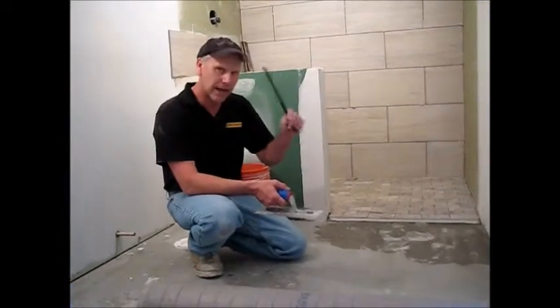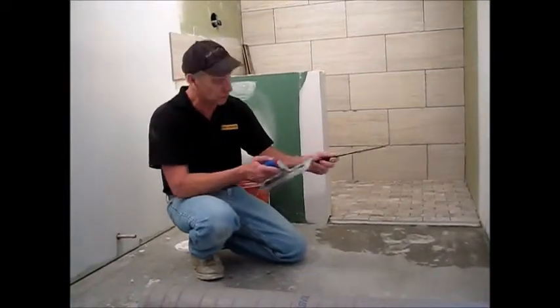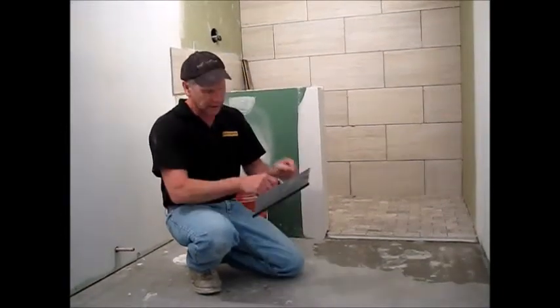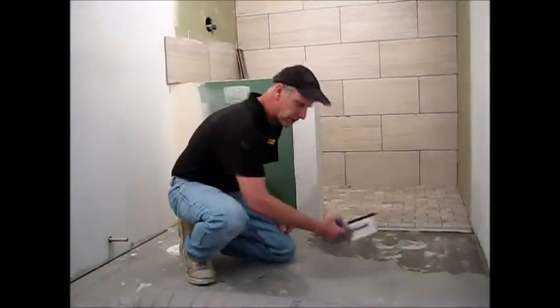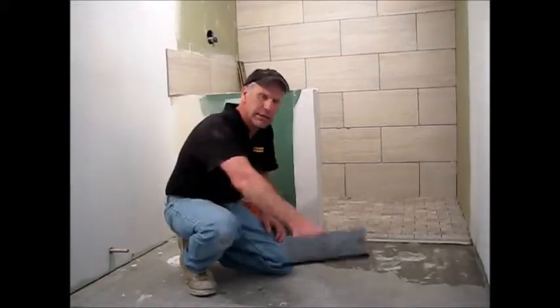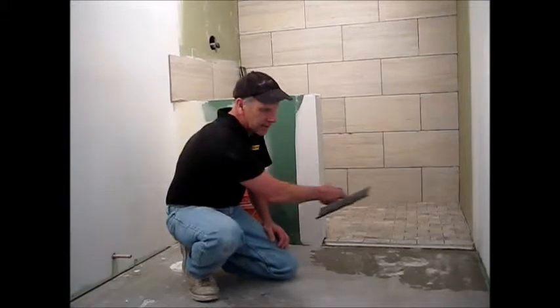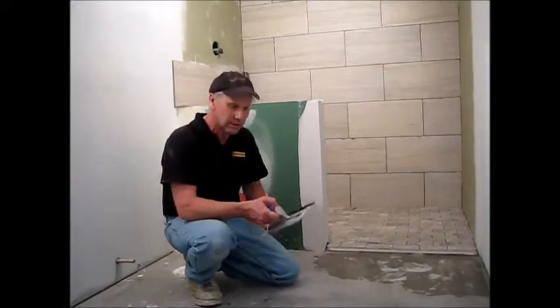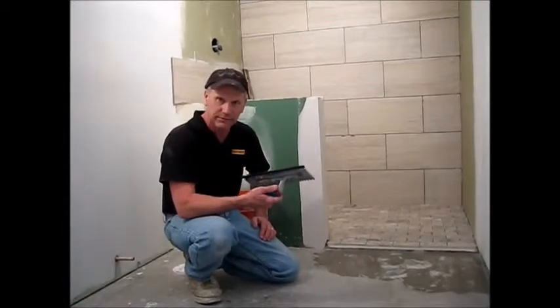I mentioned our MTP555. This tool will fit onto the back of my metal trowel. I have my comb side for putting in my thinset, and I have a plastic side here to protect the wire as I embed the mat into the thinset, and that is I back trowel the thinset over the wires. No way of ever damaging the wires by using an MTP555.